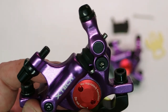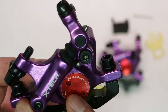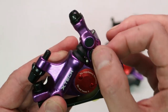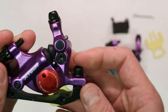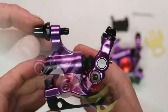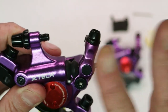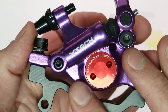The cap was turned separately and anodized in red — you can see the surface finish is different from the rest of the caliper. Apart from two holes on the cap, there are no sharp edges anywhere; everything is smooth and turns correctly. It's a budget part, but it's kind of confidence-inspiring. The caliper has two adjustments: pad contact via this screw, and free stroke over here. The range of those adjustments is to be determined once I mount it to a bicycle.